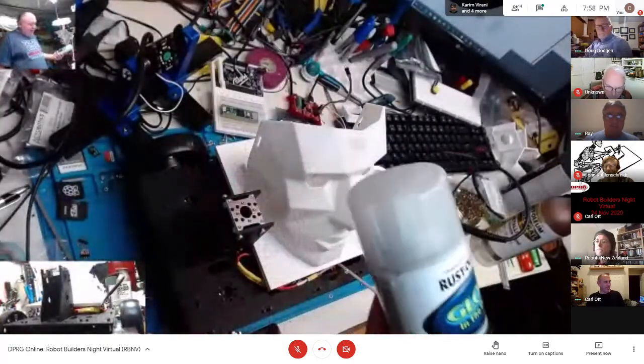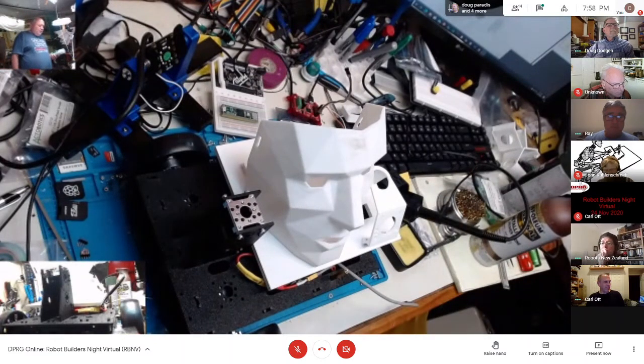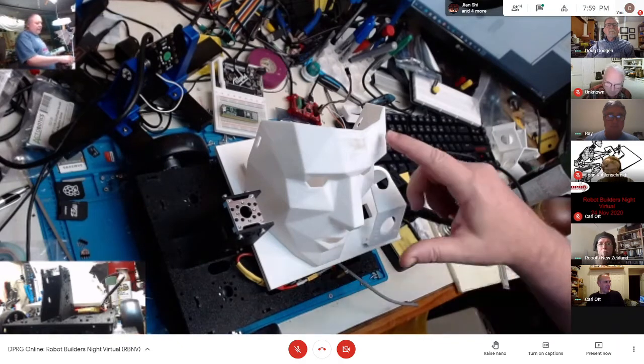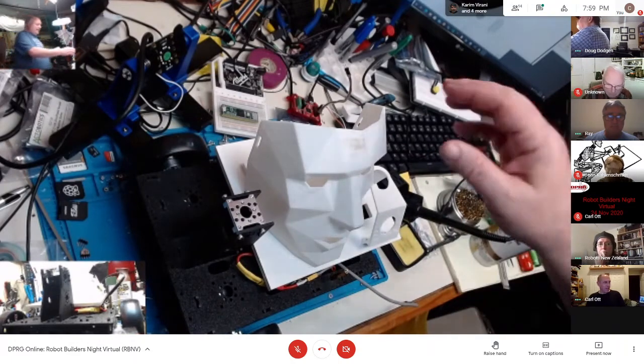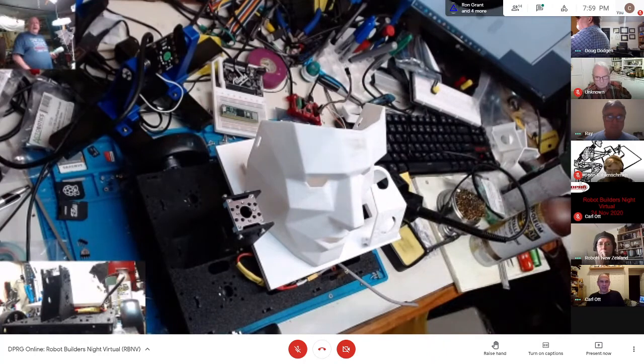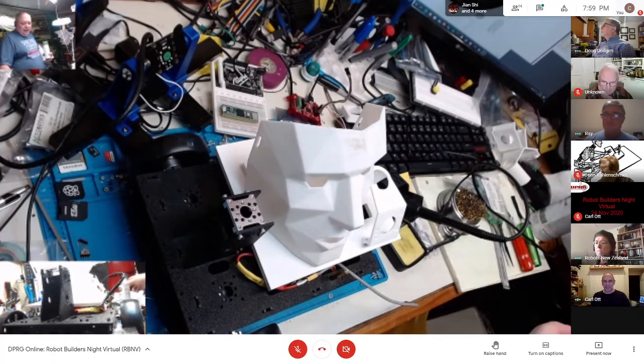It's some layering going on. Yeah, I'm going to have to do that. And I have a sneaky suspicion that along with those drippy things, I will more than likely put somewhere around half a dozen light coats of this paint on the various pieces before it gets screwed together again, to get a nice good coating on it. And those layers will help fill in some of the lining that the 3D print is going to make show up. You can see the lines on here, but you really don't see them until you hit it with a coat of paint. And then it's like, I just shined a big old flashlight on every one of those lines and then magnified it. So several layers of this paint usually helps with all that. Usually helps. Not all, usually.